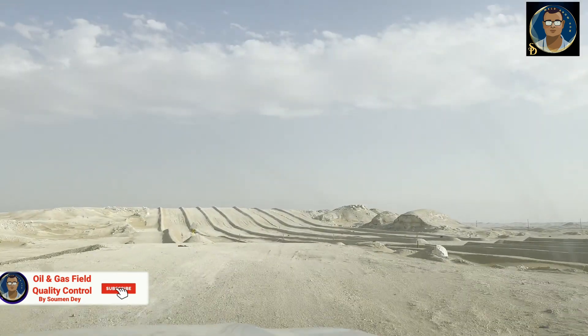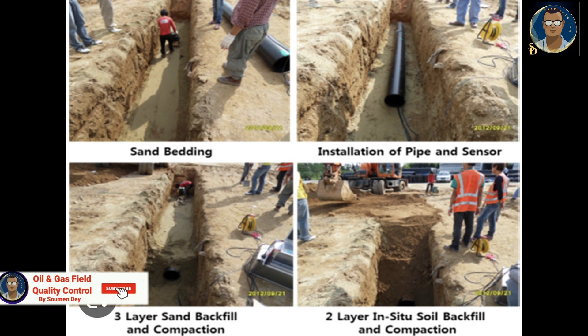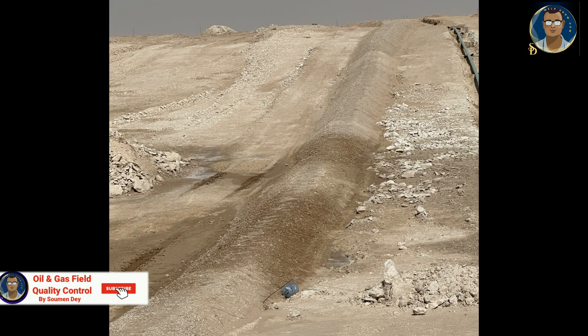After successful completion of the test, or before the hydro test, we must backfill most portions of the line as discussed. Before backfilling, the RTP line pipe should be inspected to ensure there is no visible damage and that the pipe is bedded on smooth soil so that the weight of backfilling will not press the pipe down or create a point load underneath. Care should be taken with backfilling — particularly the first foot of cover should not contain any large rocks — and the pipe should be covered gently, taking care not to allow mechanical equipment to come into contact with the pipe. Large rocks, large pieces of frozen soil, and tree trunks can be used once a reasonable cover over the pipe is achieved.